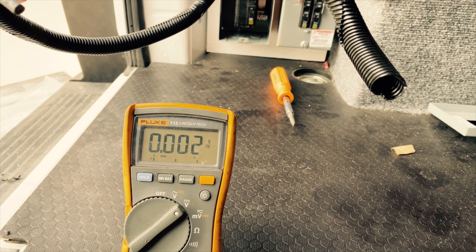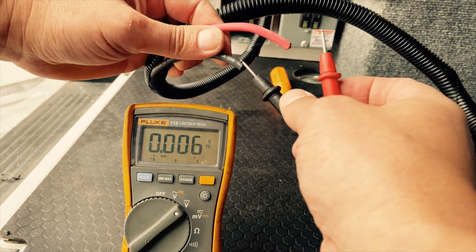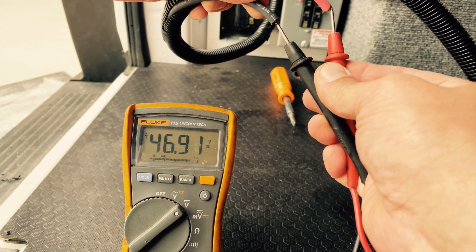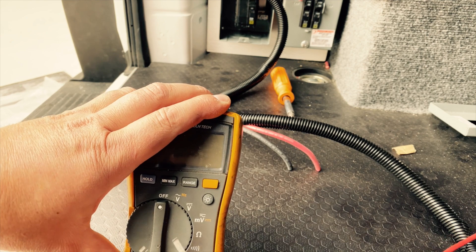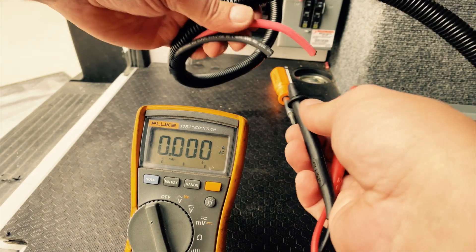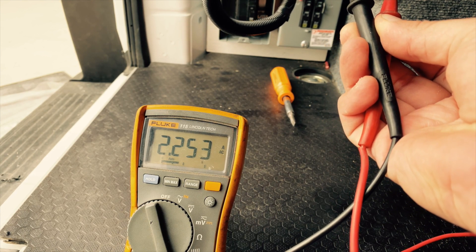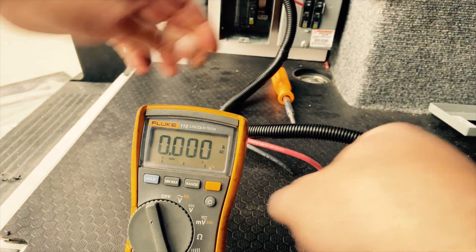Okay, I think it's recording normal video now — before I had it set to high-speed time-lapse, which was quite frustrating. So it's cloudy now, but we've got 46.91 volts — we were getting 48.8 earlier when it wasn't cloudy. For amps, we were getting 14 amps, and then in another recording we were getting about 11 amps. Let's see what the amps are now — it is cloudy outside — and we're getting two and a quarter amps. Can't really complain given the conditions.